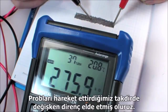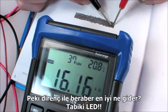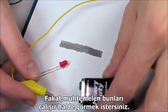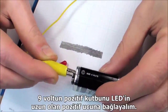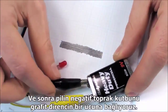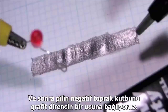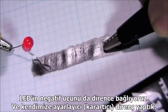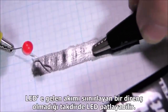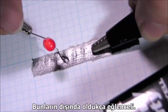If you move your leads, then you've created a variable resistor. And what goes great with resistors? LEDs, of course. Connect the positive lead of a nine-volt battery to the positive lead on your LED — the longer one. Then hook up the ground negative connection off the battery to one end of your graphite resistor. Connect the LED's negative lead to the resistor and you've got yourself a dimmer. Avoid connecting the clip and the LED directly together — without resistance to limit the battery's current into the LED, it could burn out. Otherwise, good clean fun.